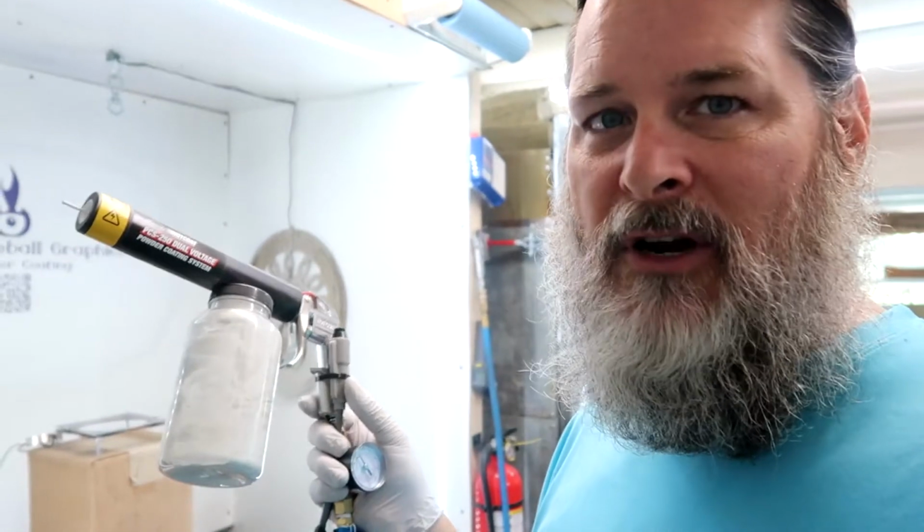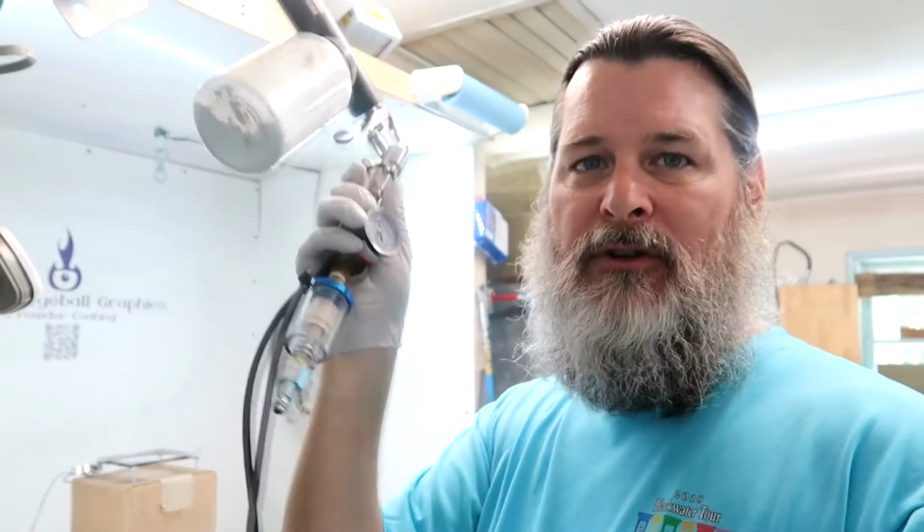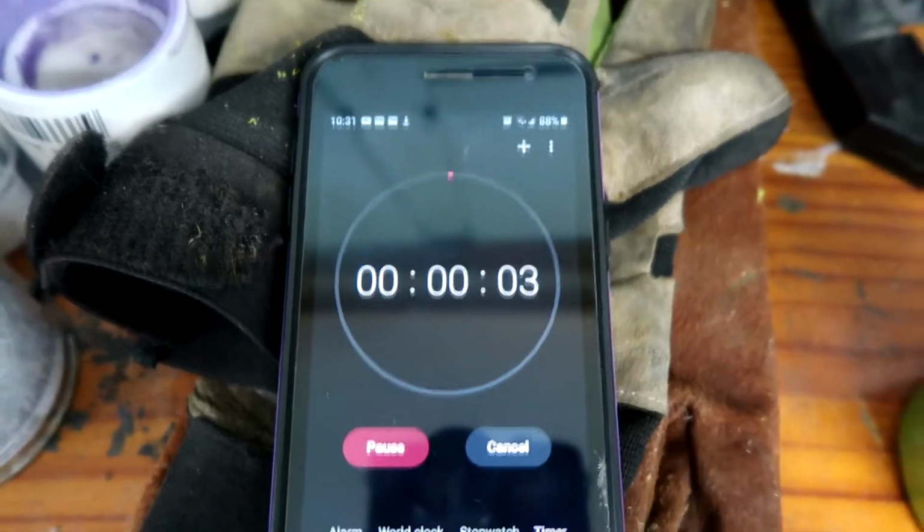One of the things that's very critical about powder coating is that everything stays dry, which is why you notice I have an air filter on here. I've got an air filter on where my air comes in from my compressor. Plus I've got a lot of hose to cool off any of the air, because compressed air, as you know, it produces water.